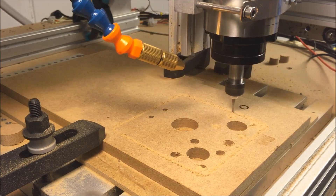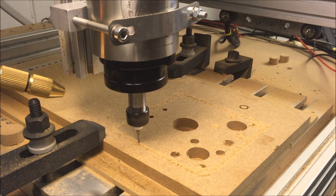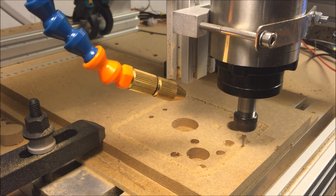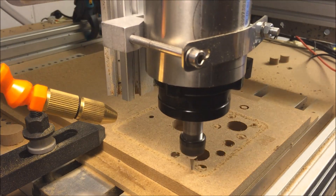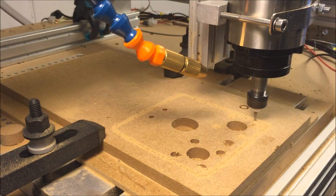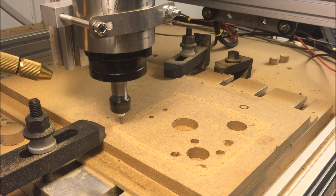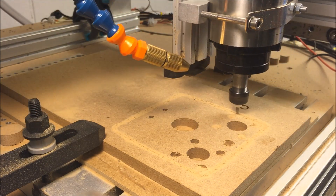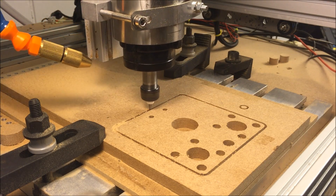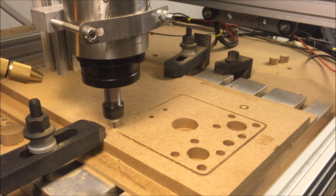I have some little holders between the rest of the material and this holder — you will see this in one minute. It's very nice because I showed this in a first video session. You can make automatic material holders or tabs. You see the material — HDF or MDF — it's very easy to mill, it's a thankful material. Every time I'm amazed how good milling is. You see these little tabs — that's the holders. You can break this piece from the other material with your hands.